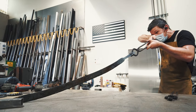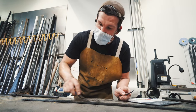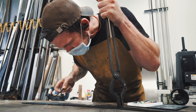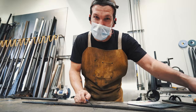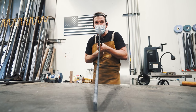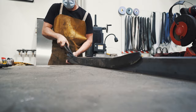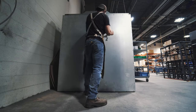Pretty straight — it's got a little bit of kink. This thing just came out of the quench; it's hard all the way down. Kind of to be expected from the flipping — it's a little bit harder in the center than on the ends. The center is skating at 65 Rockwell, and on the ends it's biting just a little bit, but the whole thing is hard. There are a couple kinks; I think I can get them out in the temper by clamping some pins and clamping it to an angle iron. If after all the temper cycles it's still warped, I'll have to re-quench.